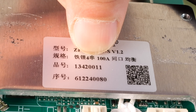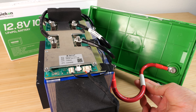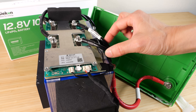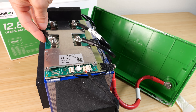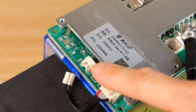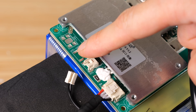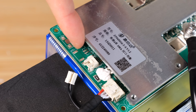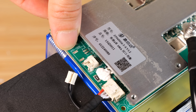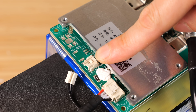The JBD brand BMS, capable of supporting four cells at 100 amps. You have a four gauge wire coming into the battery. Coming out of the battery and into the BMS are two seven gauge wires, and going from the BMS to the negative terminal is also two seven gauge wires. If you look at this temperature connector, it says NTC 10K and another says NTC 100K — these are just different kinds of temperature sensors. NTC stands for negative temperature coefficient, so the hotter it gets, the lower resistance they will be.